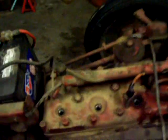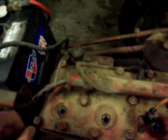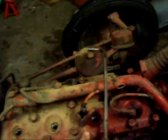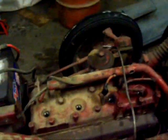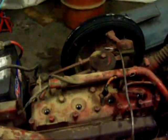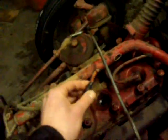And that hole we got only 30 psi, and I put my cylinder leak down tester on it, and I could hear it coming out the exhaust on that one, so maybe a valve issue in there. This one had 50 psi in it coming out the rings on my leak down tester, so that's, I guess, to be expected. If you look at this wire, it's been taped up, and it's orange, and all the rest of them are gray, so somebody put it in there afterwards.